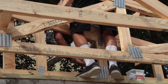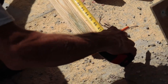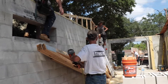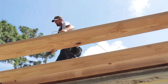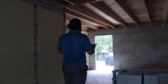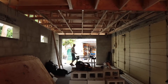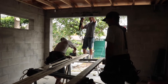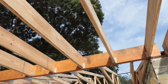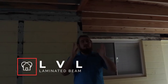For framing the roof structure, there are really two sections to it. There's the portion at the end which comes to a triangle — a gable — made out of simple triangular trusses. The trusses get set up on either end, spaced 24 inches on center with blocking in between them. On the flat area portion, we use what are called rafters. The way we marry these two sections of the roof together is with a big beam called an LVL, or a laminated beam — actually two 12 inch LVLs sandwiched together.